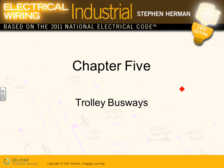Feeder busway takes a big chunk of load, like 1600 amp, from point A to point B, and plug-in busways take a chunk of load, like 225 amp, and distribute the load between all these equipments. Do you guys remember that? Now a third type, so there's feeder busway, plug-in busway. The third type of busway, Derek, my friend, is called trolley busway. Trolley busway is very simple.